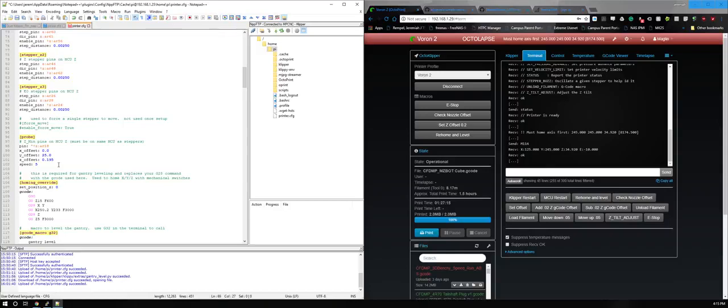And you make sure that when you put it on the switch in line, meaning you have your switch output basically going to the diode, when you look at the diode from the side, it has a stripe on the top or the bottom. That stripe needs to be on the top, meaning if you follow the path of the current coming from the sensor, it hits the top of that stripe on your diode, because what it's doing is stopping the power from coming through. Some power does come through, but it's not enough to go over the switch value of on or off. Anyway,